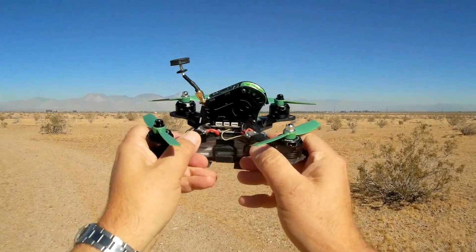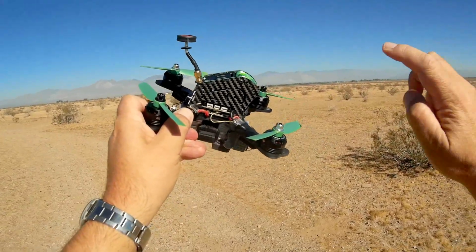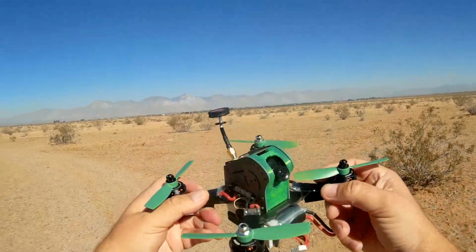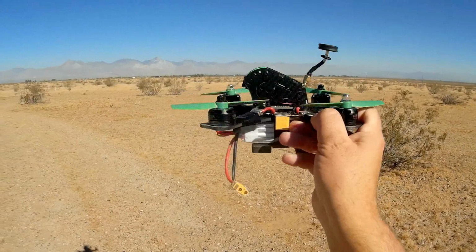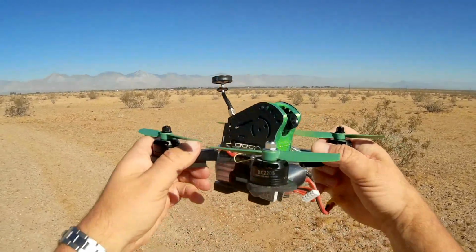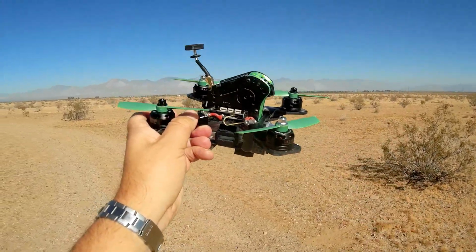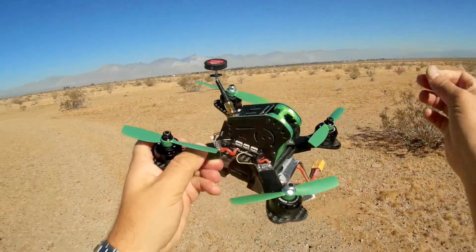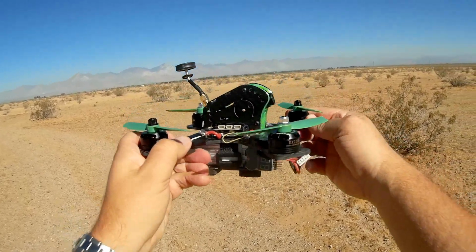But all in all, this particular quadcopter needs some tuning once you get it. I recommend you get rid of that Cleanflight, remember, and flash it with Betaflight. It becomes a much better flyer once you put Betaflight on this. Again, the original version of Cleanflight just did not work. It had wobbles. Additionally, the on-screen display, I don't know if that was a problem because of my flashing Betaflight, but I checked the VBAT values, and they all match other quadcopters that I got. But I'm not sure why I was having problems with on-screen display being inaccurate.